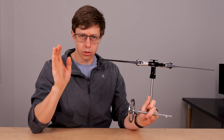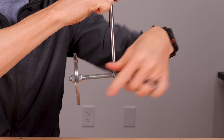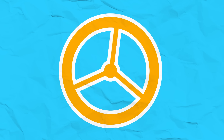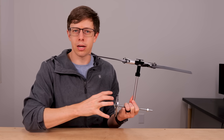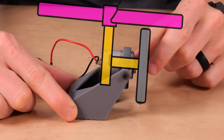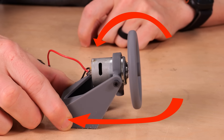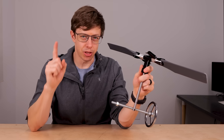The design still has a problem: the flywheel is going to try to turn the blades, but an equal and opposite reaction will try to spin the flywheel the other way. That won't actually happen because the flywheel acts like a gyroscope — when you spin something really fast it resists any changes to its orientation. There'll be a torque trying to twist the flywheel, but it will resist, which causes something very non-intuitive called precession: trying to twist it one way results in a torque that twists it another way. This is really bad because it'll just make my helicopter flip over and crash.